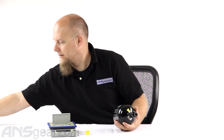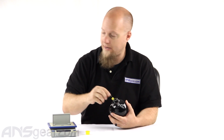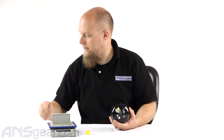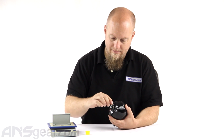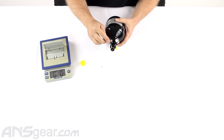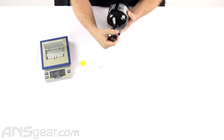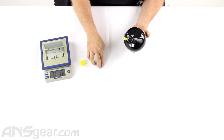Let's find, hopefully I've got an Allen key sitting around here, which will undo this real quick. That's not the right size. Let's try this one. Nope. I gotta have one here. That seems too big. With all these ones I have sitting around here, you'd think I'd have the right one just ready to go. Let's try this one. Hey, look at that. So if you just remove the 2 set screws off the top here, you obviously want to make sure the tank is degassed, that it doesn't have any pressure in it. You don't want to pull these screws out and then take the bonnet off if the tank is under pressure. But we got nothing in there. We can push the valve down.